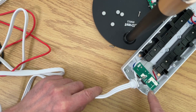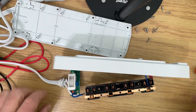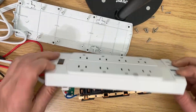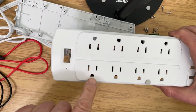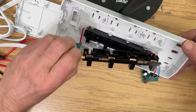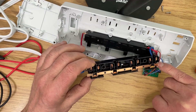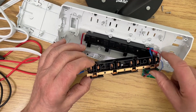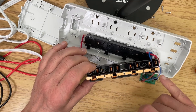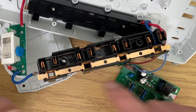One wire goes to one terminal, the other goes to the other. Where is the surge protection? I took this a step further and checked what the ground connection was connected to. When you put a three-prong plug into here — which is not grounded — what are you actually connecting to? When you open this up and look, this bus here — what we call an electrical bus — is connected to absolutely nothing. The only thing it connects to is other sockets on the strip. There is no surge protection and the ground wire is not a ground wire at all.